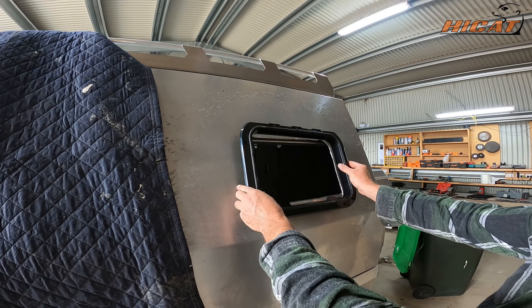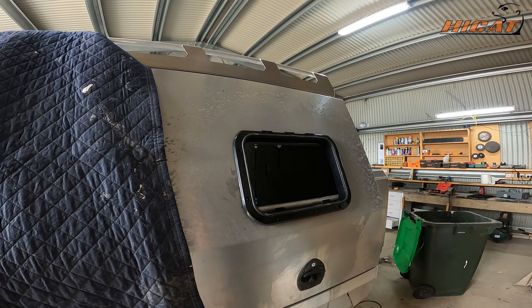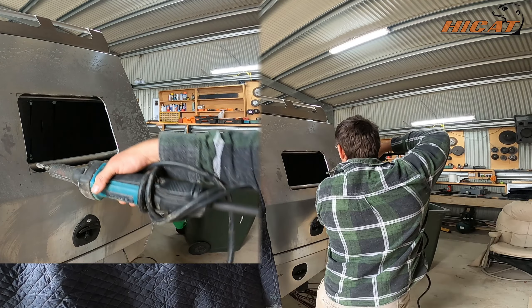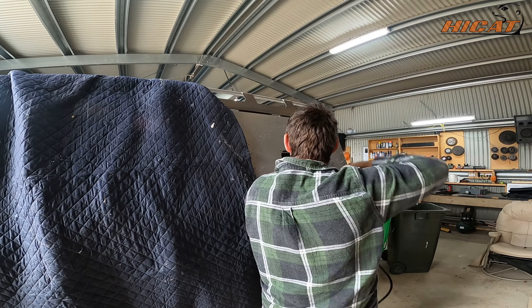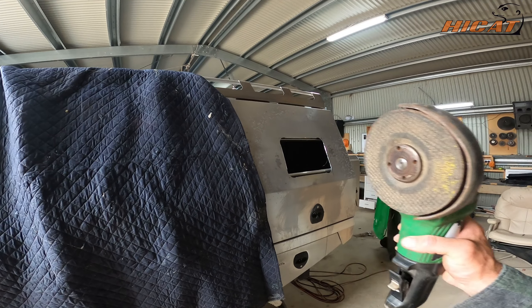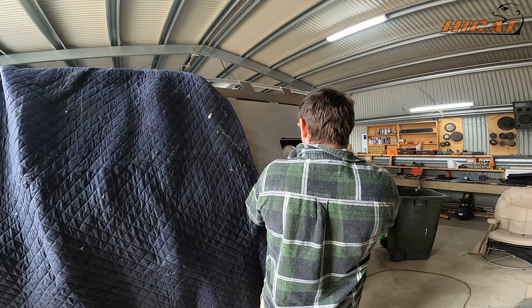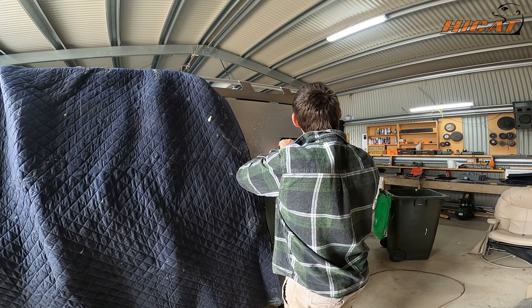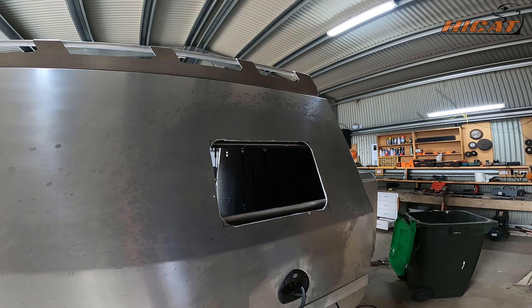Just make sure the bit's in — looks like it's going to be fine, I just need to tidy it up a little bit. I'm lucky enough to have one of these to get into the corners — it's called a pencil grinder or burr grinder. You can just use a round file, whatever you've got; this is just a little bit quicker. We've gone ahead and put a grinding disc on to attack the straight edges. Now the holes are cut and tidied up as best as needed — it's all going to cover up inside and out.